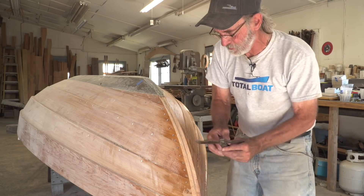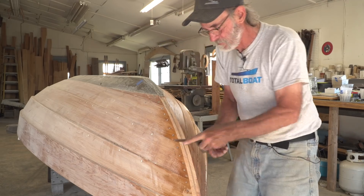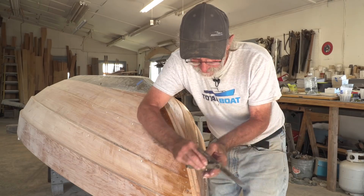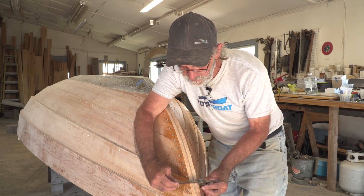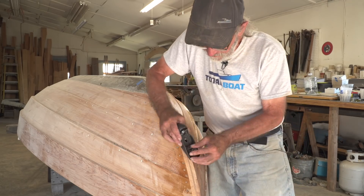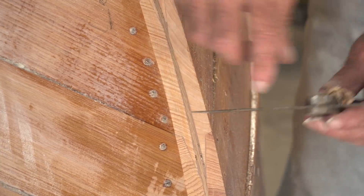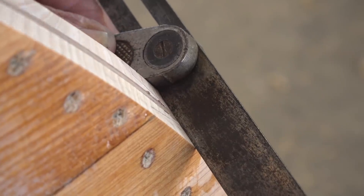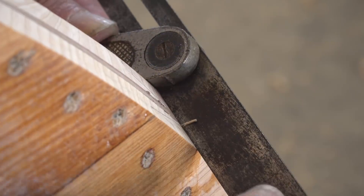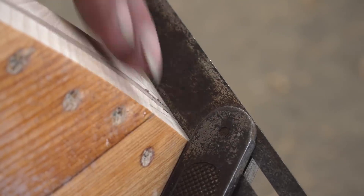I've got to keep testing it because I don't have to take much — I could go past it real quick. I set the bevel set on this side, flip it around, put it on the other side. Done, just like that. I move up, check it right here — set the bevel set on one side, set it on the other side. That is possibly a little overdone, so I take a tiny bit off right here. Test it again: the body of the bevel set against the planking and the blade against the surface we've been planing. Fits perfectly on both sides — this surface is straight across the boat, 90 degrees to the centerline.